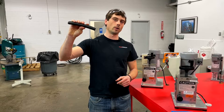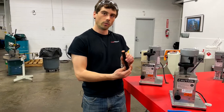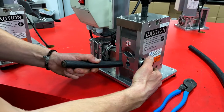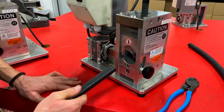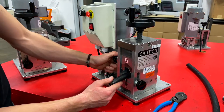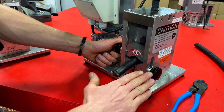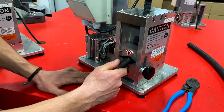Alright guys, now we're on to the big stuff — 500 MCM cable. When you're stripping cables this large, these holes on the bottom wire guide just won't cut it. So what you do is bring it to the very bottom and tighten it up down there. Now you can touch your knife off and bring the upper wire guide down. You still want to try and maintain that 15 degree angle, so get a little bit of pressure and tighten it down.